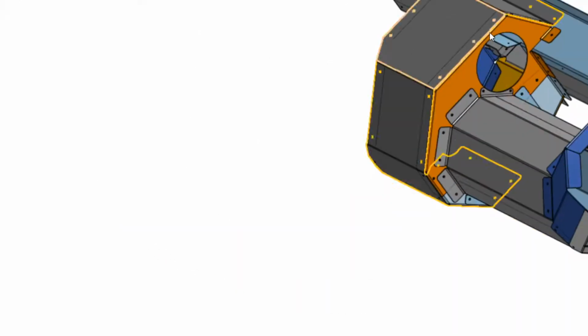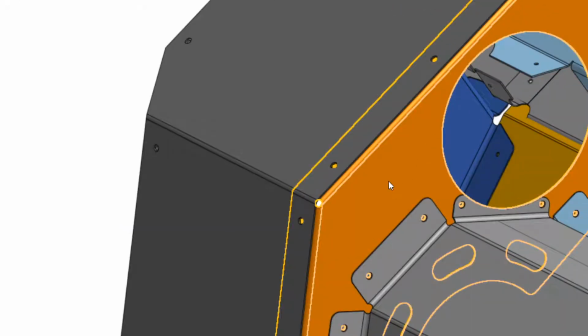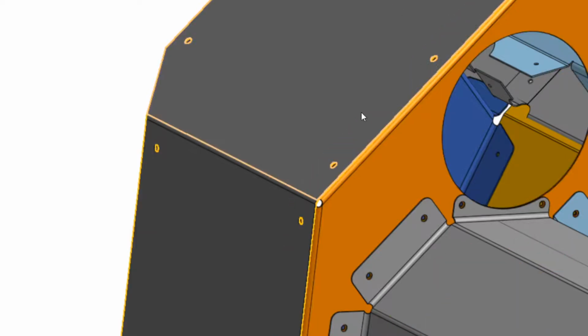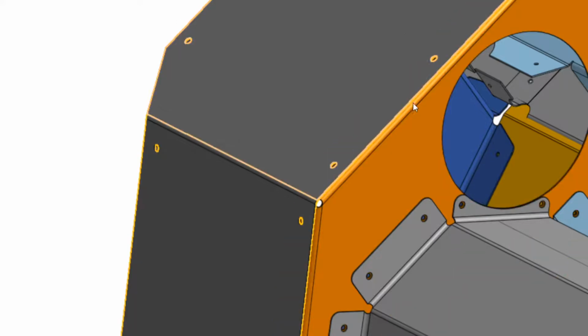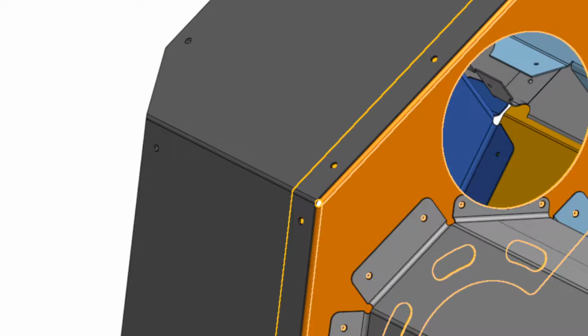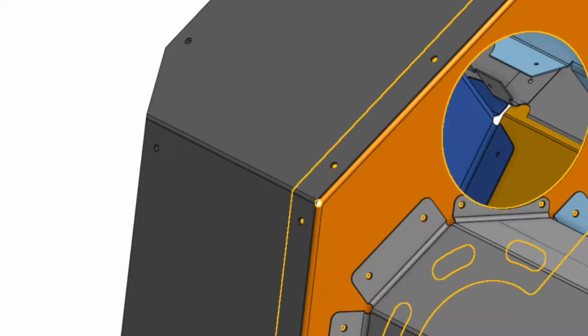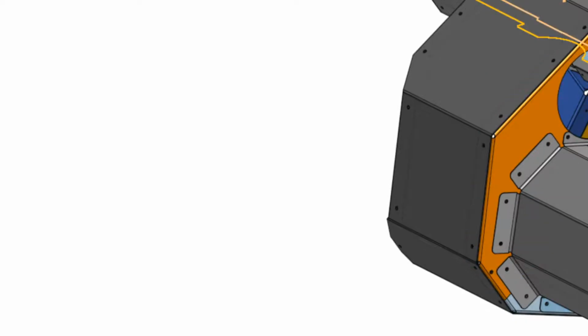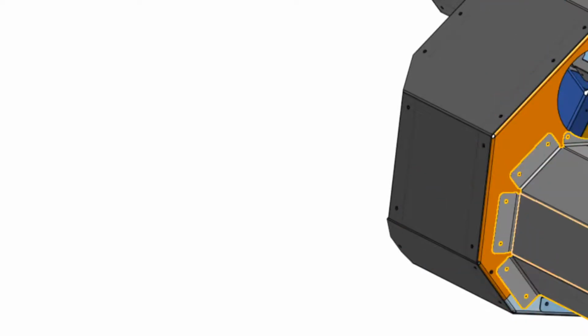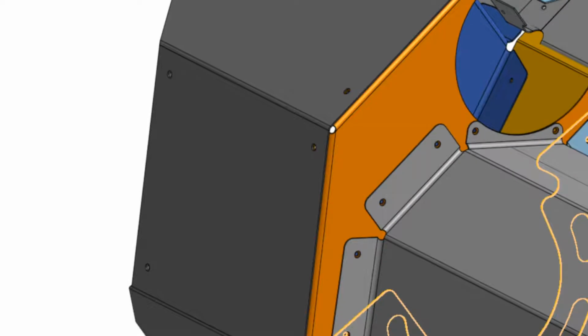After that piece goes on, we come to the top here, this brick red or orange piece. It has a flange that's bent out to the right to butt up against the manifold cover. It has flanges all around, up on top and around this way, that bend to the left, away from this face, for attachment of this cap. And then there's a flange that bends out to the right here that will fit on the top of the manifold cover as well. That one overlaps the outside of the lighter blue or blue-gray piece down underneath here.